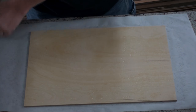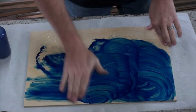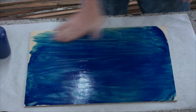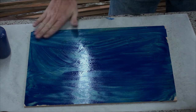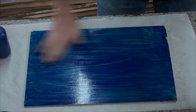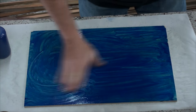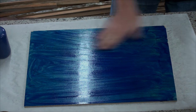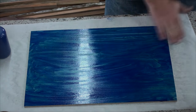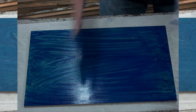Work that in. Now I like to push in and get it deep down as far as I can in the grain. I like to see a little bit of the grain show through so I don't get it on there too thick. It will darken up with the next step we do with the tung oil. We'll let that dry and then we'll come back to the next step.